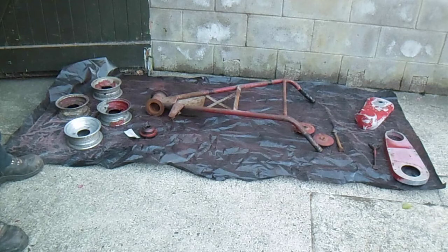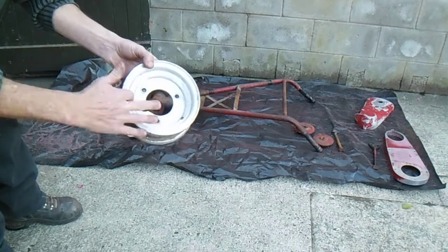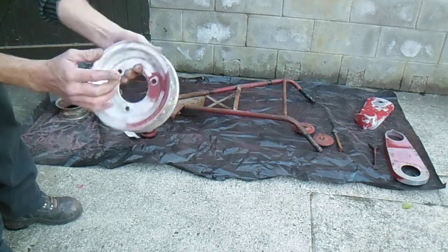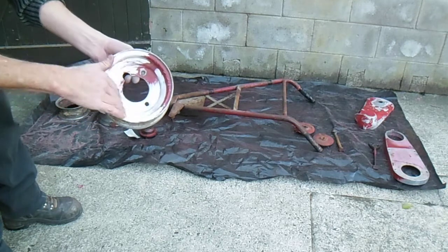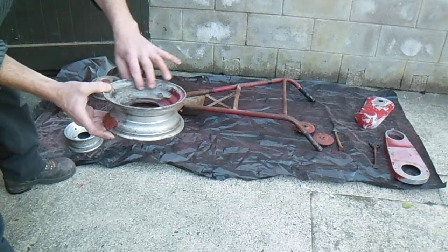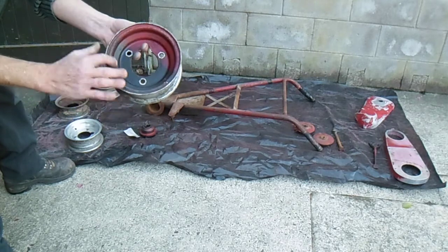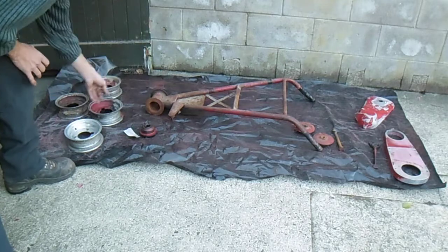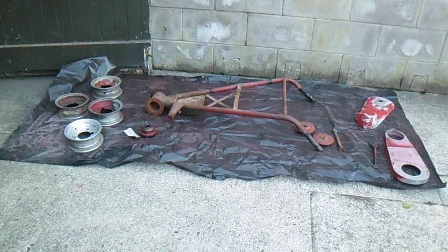Here's a quick look at what we're up to today. Got the wheels out — I've already started cleaning this one up. That's just with the wire brush and a bit of sandpaper, got all the paint out of there ready for primer. The other side's sort of halfway done — the battery drill went flat, so I'm getting enough charge out of a battery to do about one and a half sides. Not too bad. Handlebars are here — got to get rid of a bit of the grease. The wire brush might be a bit of a problem on that — it's sticky and greasy and might clog up the wires. This is the remains of the inner tube that have melted away on the inside — it's degraded, so we'll scrape that all out.